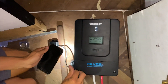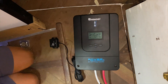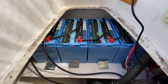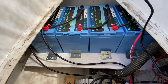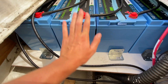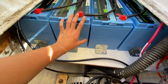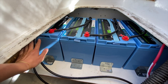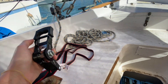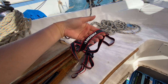This is our Renogy Rover 60-amp MPPT charger — we're going to connect this big panel to it. Today I'm mounting the batteries. The first step was to screw down the white base, then I got these brackets to put in the front and back. I was able to secure the batteries with these brackets and also with ratchet straps rated at 500-pound capacity. I was thinking of doing two straps, but I think we'll actually be okay with one.